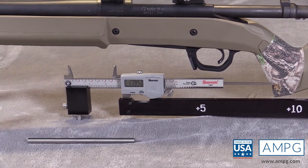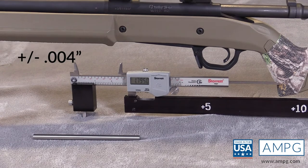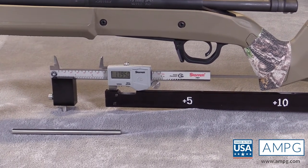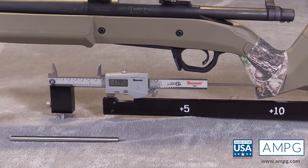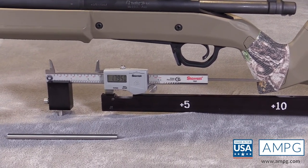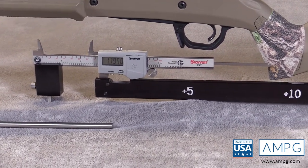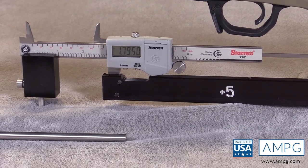The degree of uncertainty is anywhere between zero and eight thousandths of an inch, or plus or minus four thousandths. That's actually comparable to buying a dedicated 24 to 30 inch caliper, which on its own would have a plus or minus three thousandths tolerance — not much better than the combined caliper and extender setup. And yet, you can do so much more work with this kit.